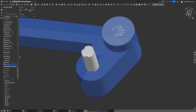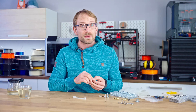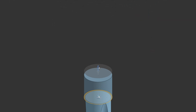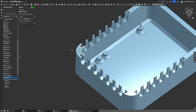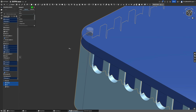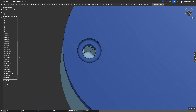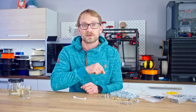Then use the boolean tool to subtract each of the negative space bodies from your part, and voilà, that's ready to print. You can even take this a step further — for example, if you commonly use M3x10 screws like I do, you could add the cutout geometry for the through hole part too. So if you have a box with a lid, import it once, place it at the point where the thread needs to start, then cut the box and the lid with the same negative space part, and you're always gonna have both halves made up perfectly with the right amount of thread engagement. I've linked these designs in the description below.